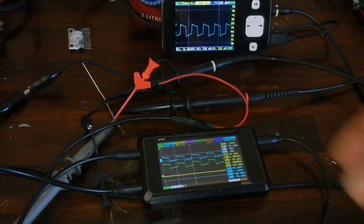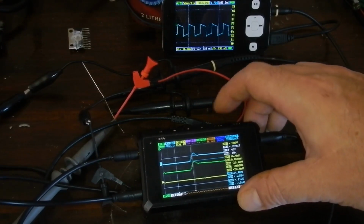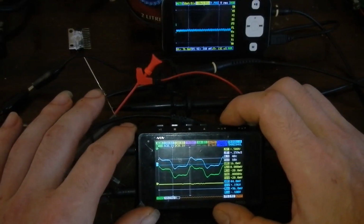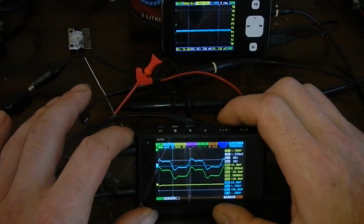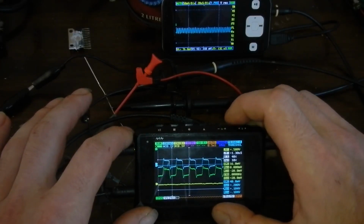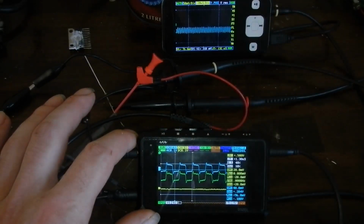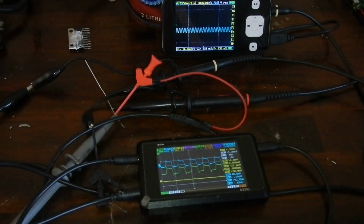That's about it for now, all I can think of, but I'll just show you quickly. I don't know if I did the fast sine waves. So there we go, that's at 2 megahertz. We're getting pretty bumpy on both those waveforms there. Okay, so that's at 1 megahertz. And again, it depends a bit on where you put your voltage scale. And I know that that little spike and that little dip are both due to poorly calibrated capacitors in the back here. You just can't get them any better than that. So, as long as you know what you're doing, it's not bad.